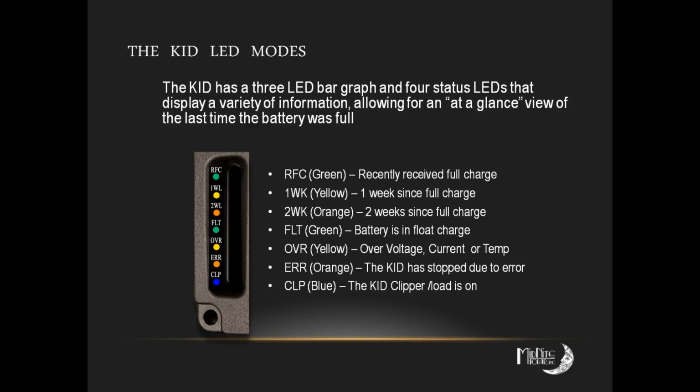Right, and of course, we'll cover how you can expand the system shortly. So you could have 60 amps worth of current using 2 parallel kits, but a single kit would clip under certain situations. It would be great for low light level operation, but during peak production times, you would lose that top end. So the modules are 285 watt modules, so that would give you the possibility of 40 amps in perfect conditions. In regular conditions, you'd be down around 32.